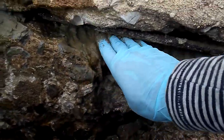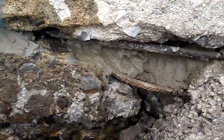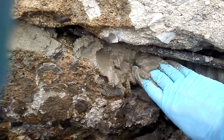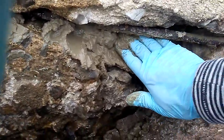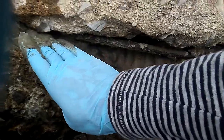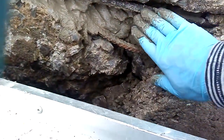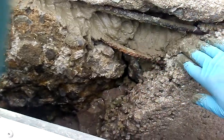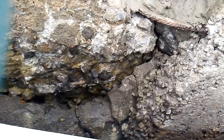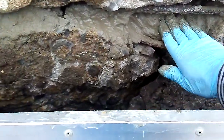Keep doing this and adding cement as long as the crack keeps taking it in. Once it stops, you can straighten it up or leave it to cure, then finish with concrete — which is fat stone mixed, so it's much stronger than plain cement. For a large hole, put a piece of wood against the wall and pour in your concrete. For deep, smaller cracks, you have to go by hand and take your time.